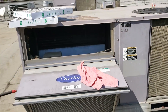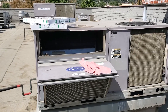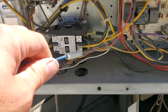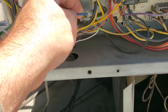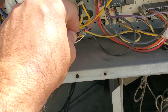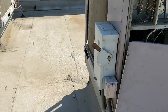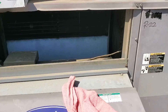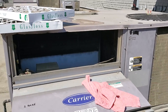So I'm going to get it defrosted real quick. We're going to shut down the unit and see if we can figure out what's going on. We're going to open this up and pull the compressor contactor control voltage, and let the unit run with the indoor blower motor for a bit. The indoor blower motor is running. We're going to let it defrost with this panel open and then gauge up and figure out what's going on.